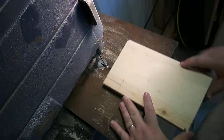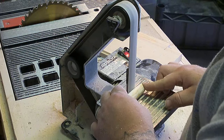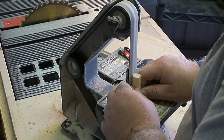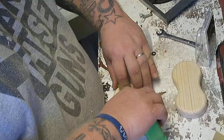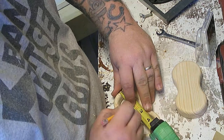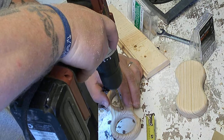I eyeballed it, lifted it up, figured out where I wanted it to sit, and took a measurement to figure out how big I needed to make the stem in the middle. I cut out a small piece from more of that scrap pine — you can make it really whatever size you want depending on how you want it to look — and then sanded it down. I was going to make it round but decided to give it some neat edges to make it look a little more natural. Then I marked a center hole in the top piece so I could get a dowel down through there to hold it to the stem and the base.